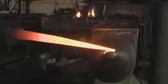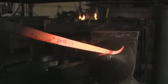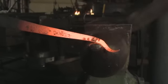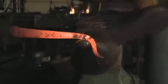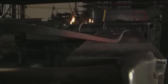I'm going to go right there to the horn, and we're going to put our first bend in. And our second. Flatten. On the end of the taper, the metal is thinner, so it gets hotter faster and it gets cooler faster. So we have to make our decisions a little bit better, a little bit faster. And we're going to chase that shape all the way down.